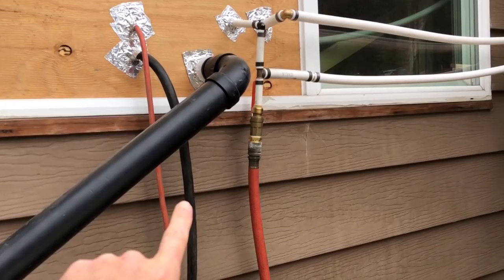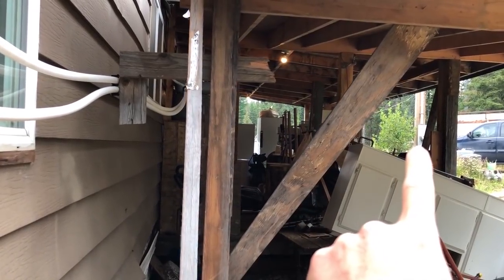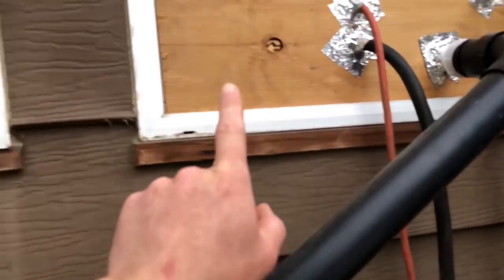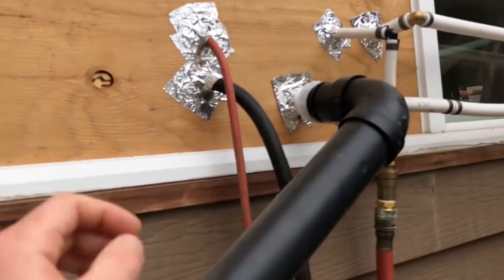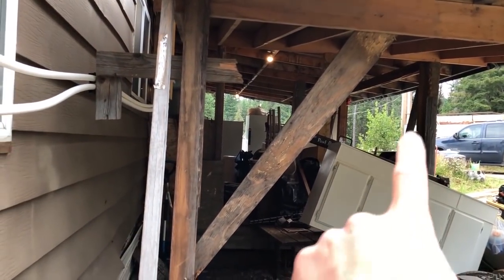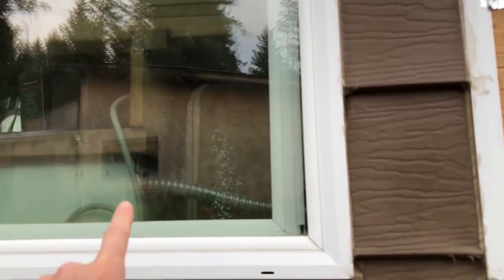The power to the oven comes through this heavy-duty welder extension cord. I have a welder outlet wired there, so I can plug that extension cord in. It snakes around here and goes in and is directly wired into our countertop inset stovetop right there. Then this is an extension cord coming from a GFCI outlet that's over on the power pole. 12 gauge extension cord pokes in through our boarded up window, goes to a power strip that's right here that we can plug kitchen things into.